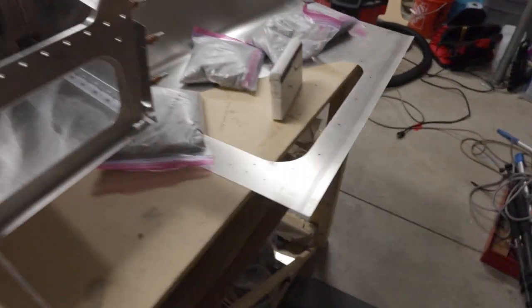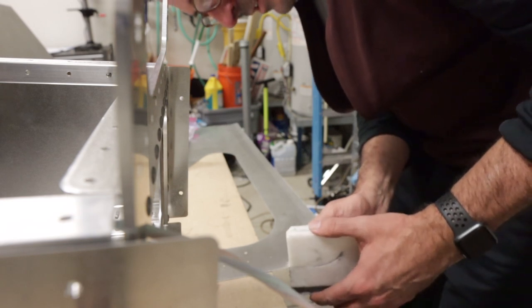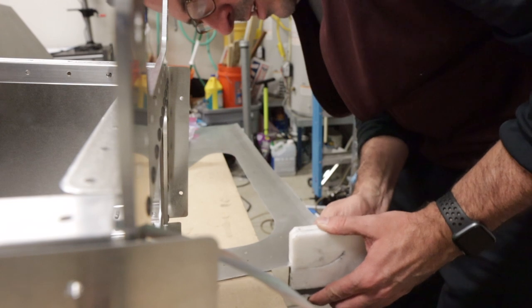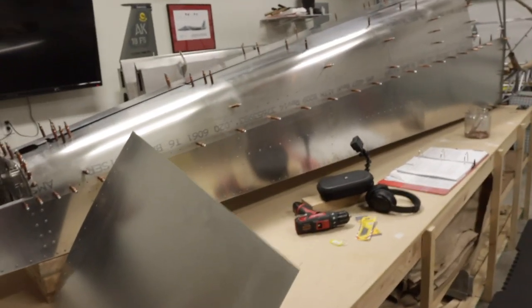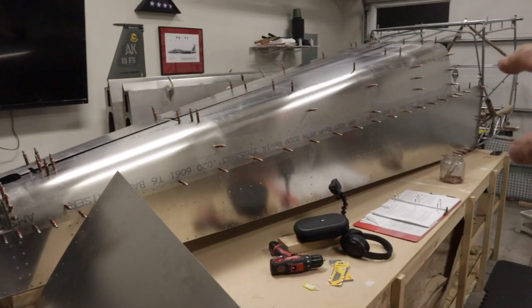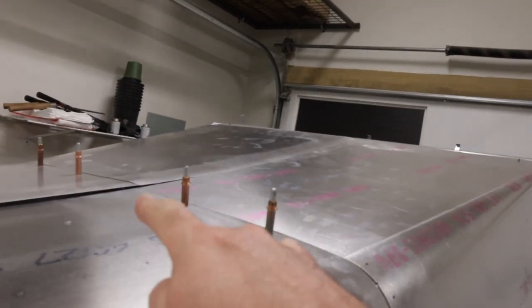I need to put a curve in with the edge forming tool — make double-sure you're doing it in the correct direction. Funny story: on one of the wing skins I did it the wrong way, so that became the other side. You do this on the wing top and bottom skin, and also on the top skin of the tail cone where it overlaps the longeron. Once riveted, it'll have a nice bit of pressure pushing down on the other side. This is the right window — you can see what the edge form does there.